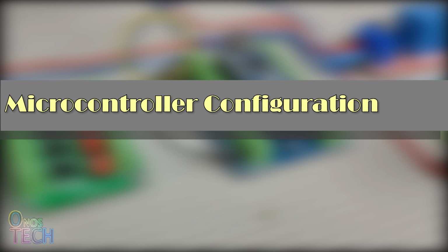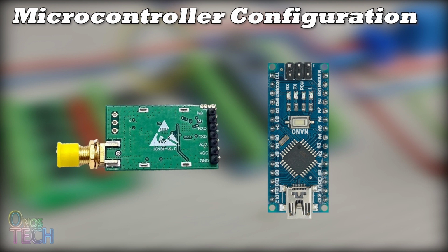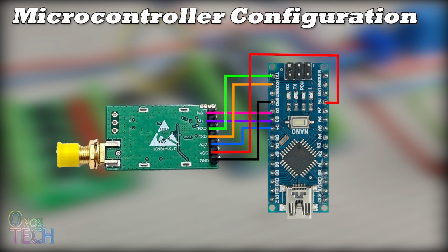The E32-433T20DT module can also be configured to the desired operating mode by a microcontroller. M0 and M1 pins should be connected to the microcontroller input-output pins, and also the RXD, TXD, and AUX pins. Specific commands in hexadecimal format sent by the microcontroller when the module is in sleep mode can be found in its datasheet. These commands only work with the baud rate of 9600 and 8N1 format.